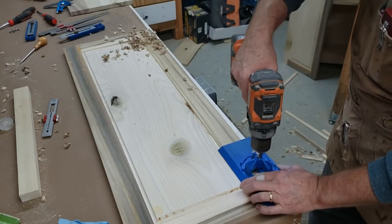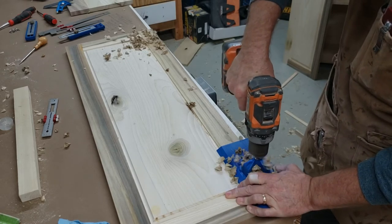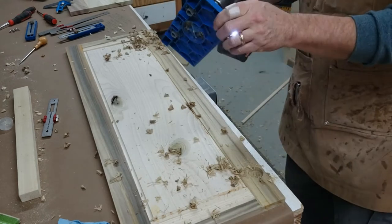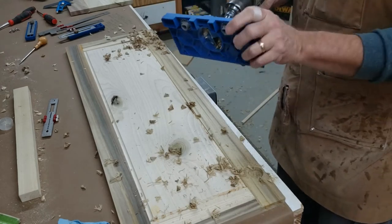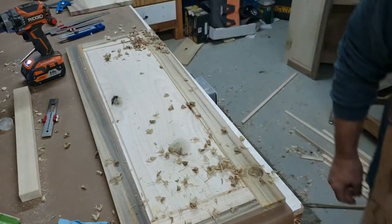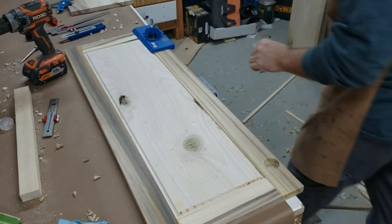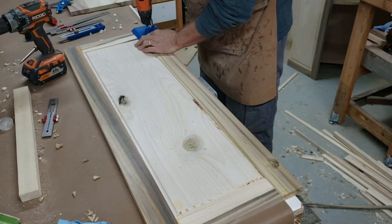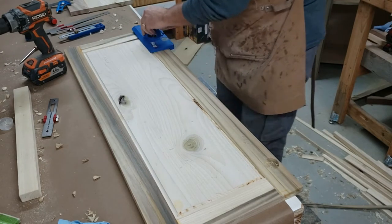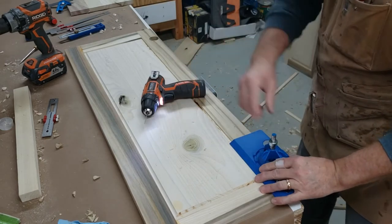I needed 8, so I have two left over. I wanted to show you the hinges and how I installed them, and the tools I used. Here I'm using a Kreg jig — K-R-E-G — this is their hinge jig. Cleaning it out because it does clog up a little bit as you drill. It comes with a 1-and-3/8-inch Forstner bit included. You'll see I've cleaned out the holes and now I need to drill pilot holes for the screws.